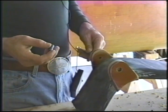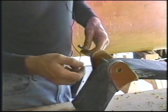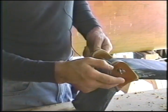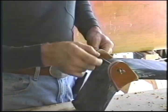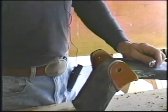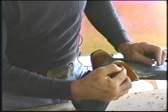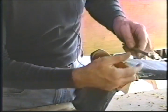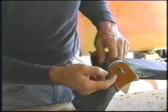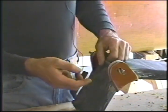We've finished drilling. We actually did something we weren't going to tell you about. We had about 90% of this whole board, and it was pretty close. We had all the way up to this last layer of phenolic. And we realized that we had created a situation where we could use a much simpler device to finish up removing the meat. But we still had the guiding ability of the perimeter of this 9/16 inch hole to provide a continuing pilot for the rest of the cut after we had removed, and very quickly I might say, about 3 seconds worth. And the drill pulled itself right through.